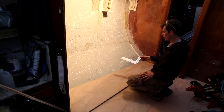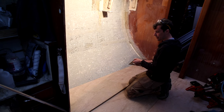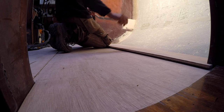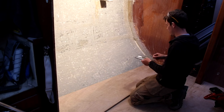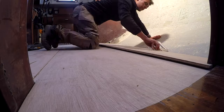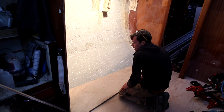I've got my scribe tool ready to go. Once we've got our merchandise shop up and running, everyone can buy one of these. I'm just going to very lightly do the first line. The board is ever so slightly tilted down at the end because we're about 12mm higher than we want to be, so it is tilting down ever so slightly. It's not perfectly in the right place, but it gives us a better shot. The two lines I've got in there so far are very close to each other, which is a really good sign. This is so uneven — I'm just trying to get four or five lines in and then I'll basically go down the middle of all of them.